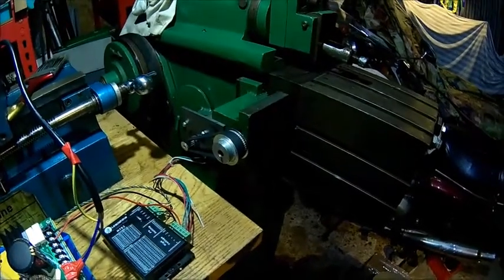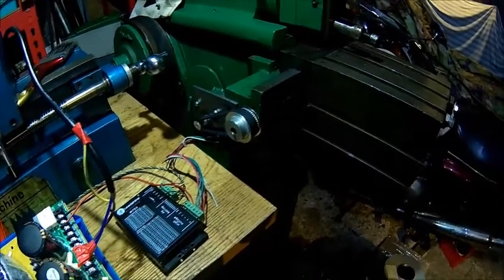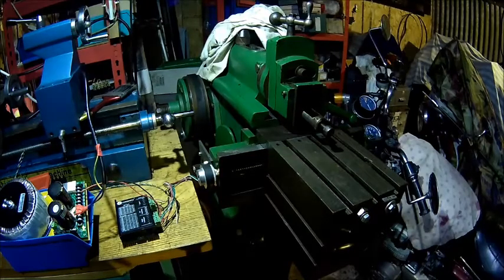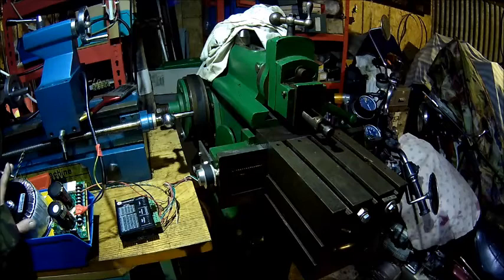I think the motor is capable. The problem is I can't run this driver on the six-wire setup — it doesn't draw the current. The motor says 10 amps and I can only draw five with that driver. Further plans are to write some software myself, because there's no useful software really to use with a shaper. We're going to figure out when the ram is on the back and then do the movements. Now it's wintertime and the shop is cold, so I'd rather stay in the electronics lab and do a bit of software and electronics. I just wanted to see how much that stepper motor is actually capable of and if the setup works okay.